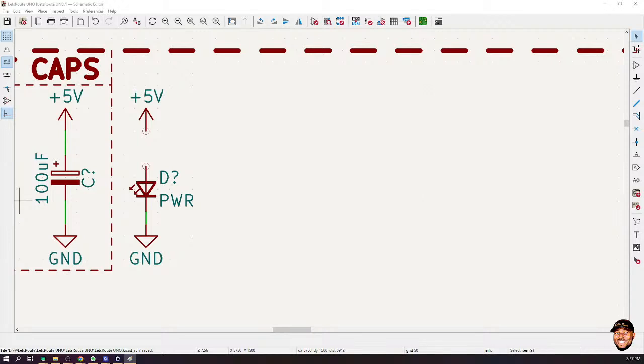Okay, so these are some of the things that you should look at when you are choosing a resistor. Not just the resistance, but also the wattage, because the wattage also determines the size, how big the resistor is. Okay, any questions? So we know that we need a 300 ohm resistor.